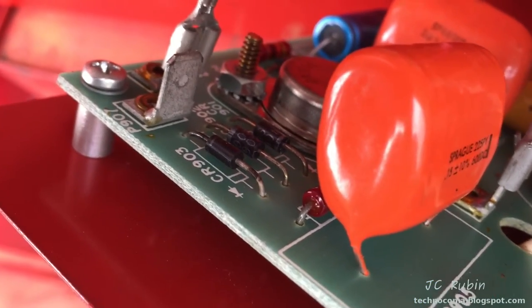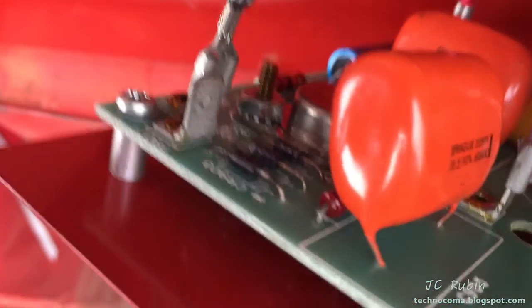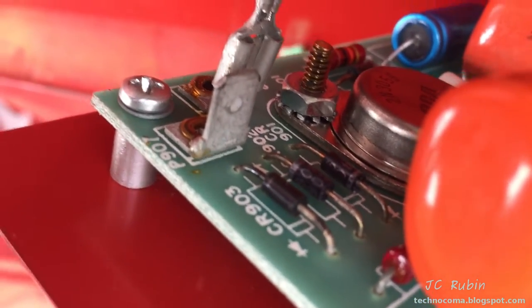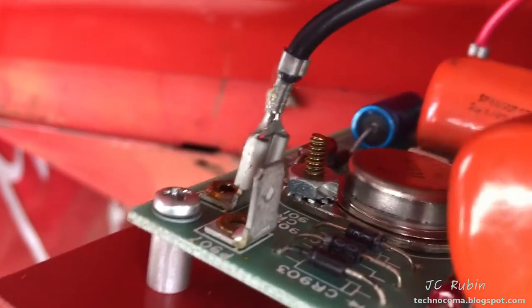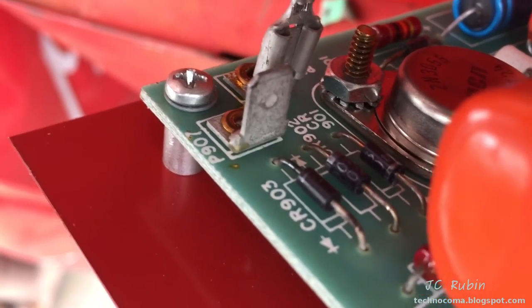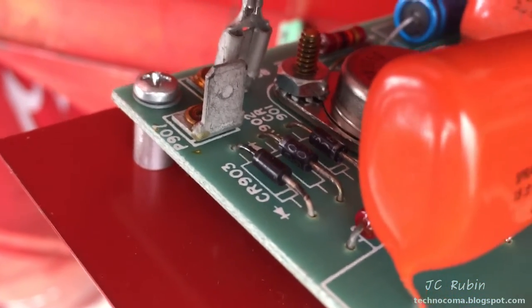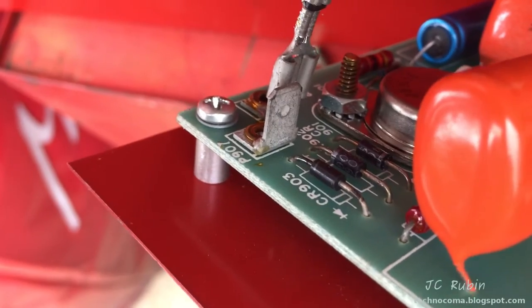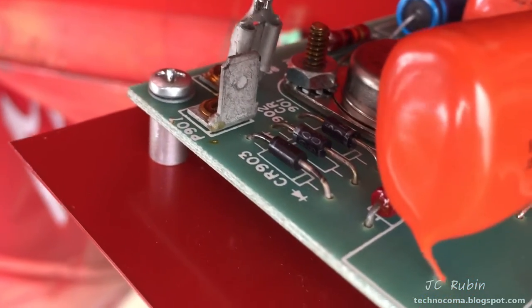Jason tells me that the previous owner said this thing has always worked. When I looked at the solder on the bottom, it doesn't look like this was re-soldered, but this diode looks entirely different in its markings from every other diode on this unit that uses a silicon diode with a 0.7 forward voltage value. All the other diodes have the same number of markings — everything but this diode — and this diode is backwards. If you have any number of diodes in series and one is backwards, no current is going to flow in that circuit. So I don't understand why that is, but we're going to see where things die and pay close attention to this particular area.